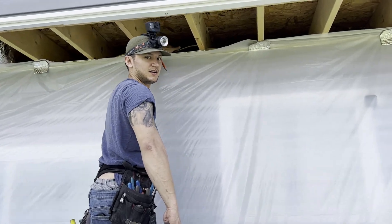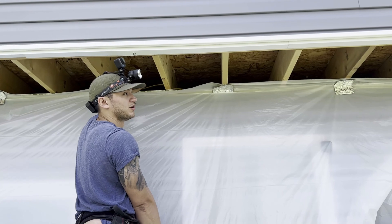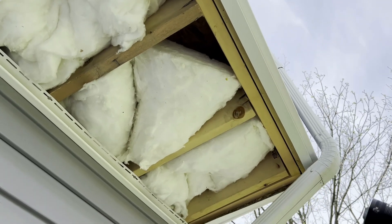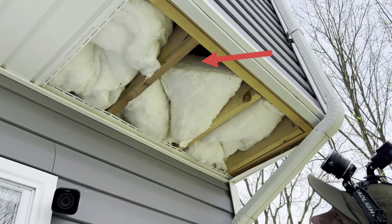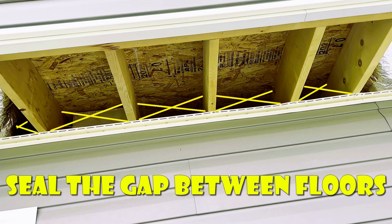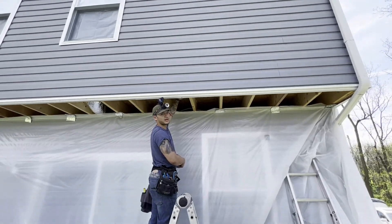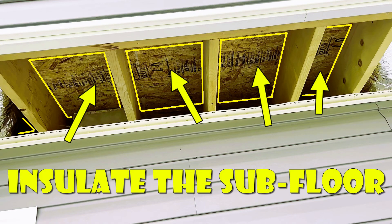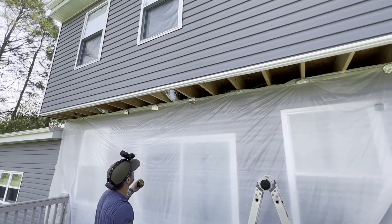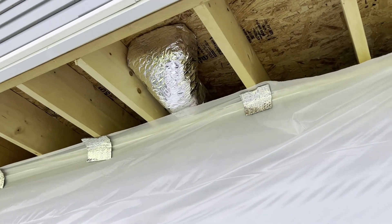So by blocking the area with the Skyflex and foaming it, what are we going to accomplish? We're going to accomplish an air barrier and also a thermal boundary. Right now it's kind of a thermal boundary set in place with the way the insulation is laid right up against the floor — some places were good, some were bad. But now we're going to have an airtight barrier that blocks the air from going into the house. You don't have to worry about duct sweating or discomfort in the lower or upper level. Then we'll bring the thermal boundary to the floor right here with the spray foam. Right now the duct is about R4 to R6 bubble wrap, so we're going to foam it to the floor — it'll get a lot warmer and work a lot more efficiently.